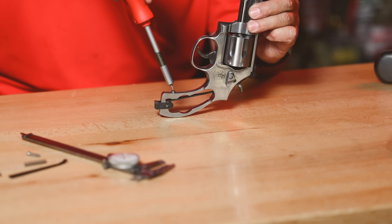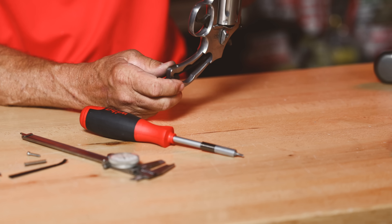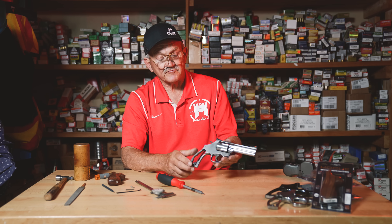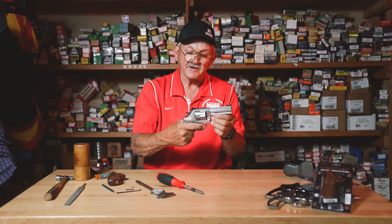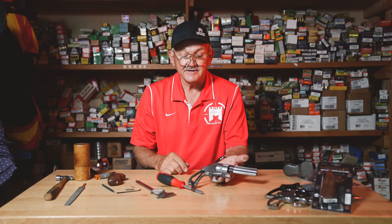If you don't want to cut the screw, you can leave it protruding and put some blue Loctite on it to lock it at that setting. If you want to change your spring rate later, you can do that. That's the way I like my guns set up. What I'm looking for is that really crisp, fast trigger return spring — because when you're shooting double action, the trigger release is probably more important than the trigger pull. That's the Michelec spring kit installed.